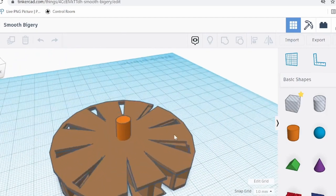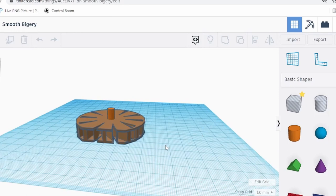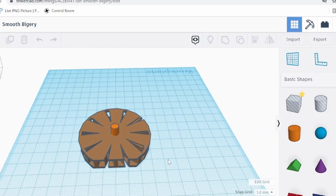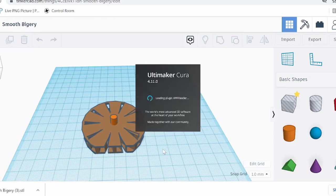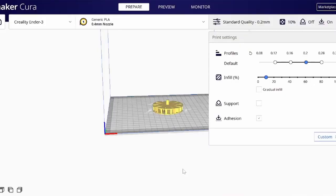We actually did most of this design ourselves — I borrowed one piece from somebody online. Once you design one of these things, you use a platform called Cura — C-U-R-A. You design what you want 3D printed, then export the file. I've downloaded Cura already and it converts your design into layers to show the 3D printing process. From here, you put a jump drive in, get the information from Cura, plug it straight into the 3D printer, and get your product.